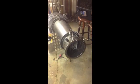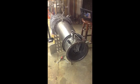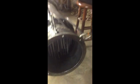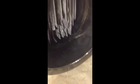Here the engine is laid out with both the pistons and kinematics assembled, then standing assembled with the firebox — we're just using an oil drum as the firebox here. From the front you can see the hot end without the cap on it, and if you look closely inside you can see the displacer in there. You can see how the kinematics are working — it's receding into the cylinder and coming back up at the head of the cycle.